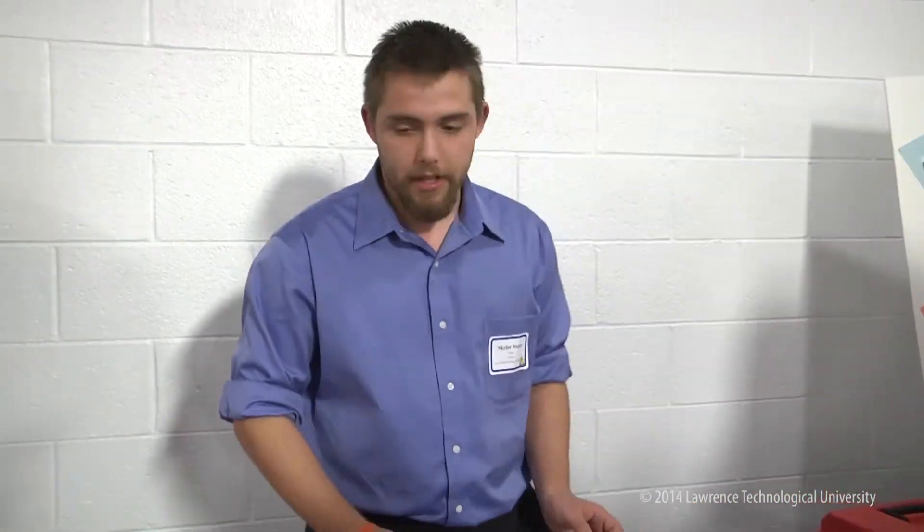All of these parts were 3D printed — everything was made from scratch, nothing was from a kit. We programmed in assembler using a PIC microprocessor. The reason we chose assembler is because the include files are smaller and it takes less power, so we have more room on our microprocessor to do complex moves and add in extra things like the ultrasonic and the infrared.